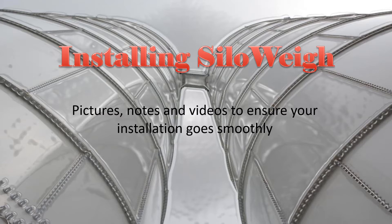This presentation shows you how to install the L-strain sensors on various silo legs and wire them to the DJB and indicator. Then it shows the bolt tightening procedure to ensure that you don't overstress the sensor, and all the other things that make this installation a success.